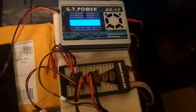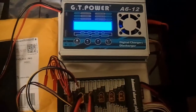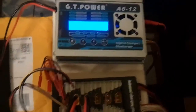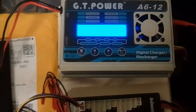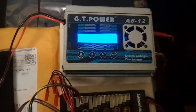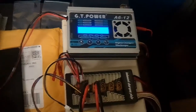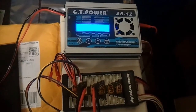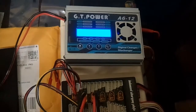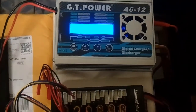I'm not too happy. I've got another GT Power charger, the X charger, which is a 6-amp charger, and it's been really good — it even does internal lithium resistance calculations per cell. This one doesn't seem to do that. The problem is this one sustained its 25 watts of discharge current for less than a minute before it blew, then would not sustain that again. The half amp at about 11.6 volts after the shutdown translates to just barely over 5 watts, so it lost about 20 watts of discharge capability in the first minute — and it seems permanent because it did not recover.